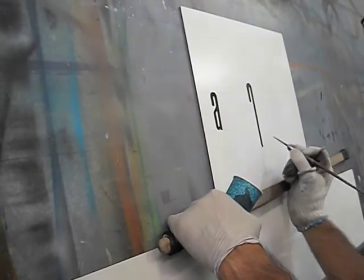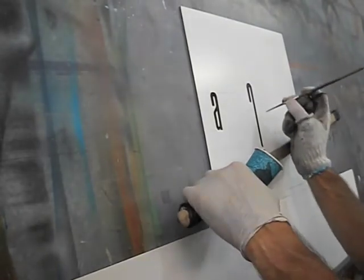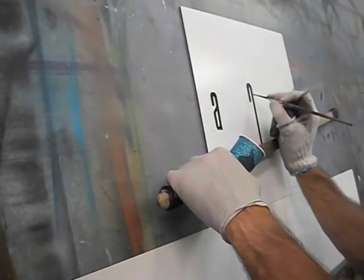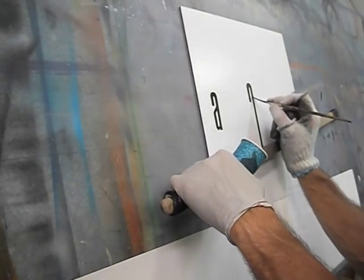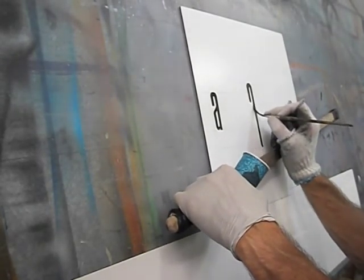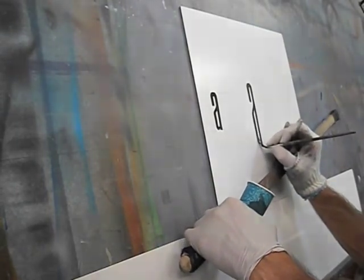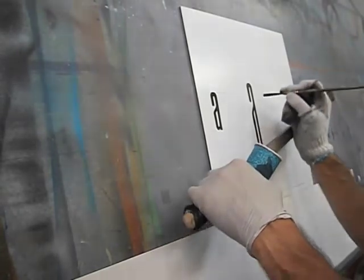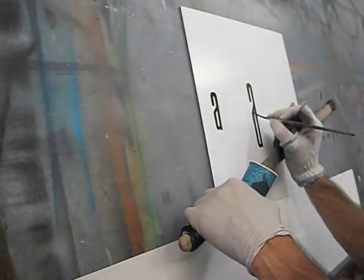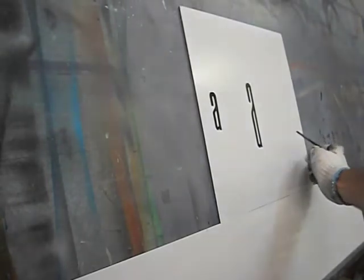Spin it off to the right, make our little bottom whip on the right. And we come down, make a 45, and we line ourselves up with that, and also our eighth inch gap. So we're just going to come down here, round it off, eighth inch gap. And then just make a hook. It's all it is. We're just extending what we've been doing. That's all we're doing. And we're just maintaining that eighth inch gap.